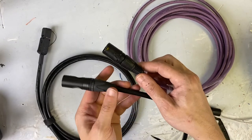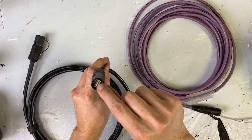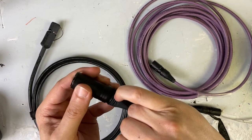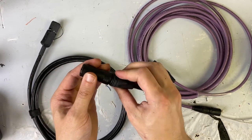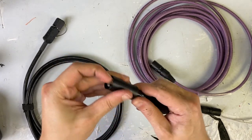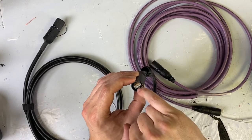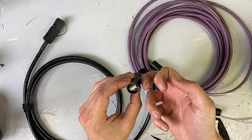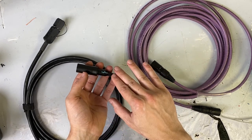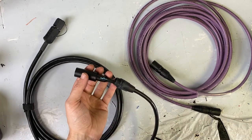Comparing the two connectors here, this cable is a carrier and it also has an RJ45 integrated into it. So if I take this apart, you do have a little O-ring right here to keep this waterproof, or at least water-resistant — I know that these are IP65 rated. And if you pull this back, you've got your strain relief, and there is actually a little cassette that goes in here. This portion of the RJ45 is static — it's permanently mounted in this connector. These are really a pain in the butt to put together. But there is a little PCB that goes inside this connector, and you crimp the cables on either side and then insert it. I have a video that shows you how this works — just check the link.